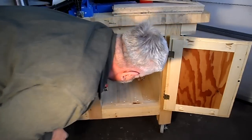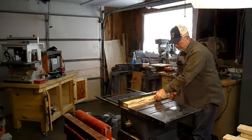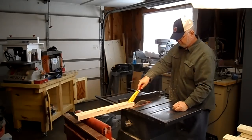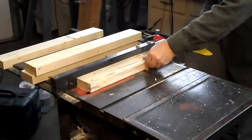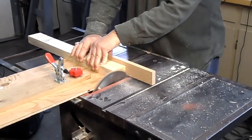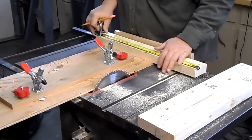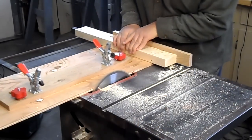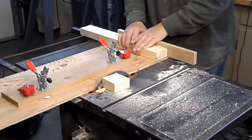I'm measuring that right now to see what I need. Prior to cutting all my boards to the dimensions, I'm going to dress up all the edges on these 2x4s to take the rounded corners off, and I'll do this to all of the boards I think I'm going to need. I begin ripping my boards to their width using my fence, and then I switch over to my crosscut sled, which also doubles as a tapering jig. Prior to cutting them to length I ensure that the beginning edge is square, and then I measured them for about 20 and three-quarters inches and cut them to length.